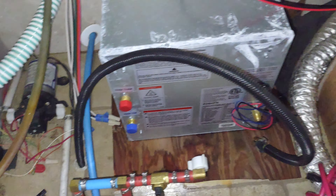It seems like the moisture is originating over here — you can see the wall is wet there. That could point back to the seam that's leaking, with water coming down the wall from that seam. I think it's taking a while to percolate underneath the wall out into this area, and I think that's what's happening at the wheel well too — it's coming down inside the wall and slowly percolating underneath the sheeting, then pooling on top of the plastic wheel well. That's probably the most likely explanation.